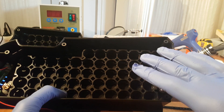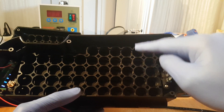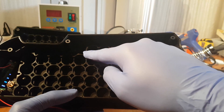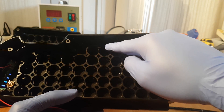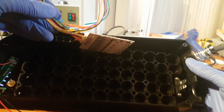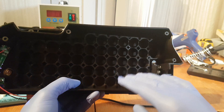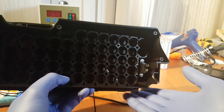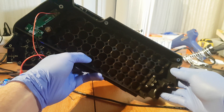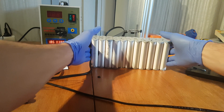I've got 52 holes for the cells, so I'm gonna use these 2 at the end and cut these 2 over here to make space for the BMS. I'm gonna put the BMS on top because the whole weight of the battery will lean on this side when it's on the e-bike. So therefore I will place the BMS on top.